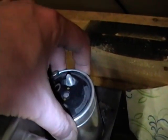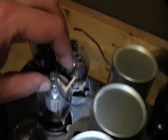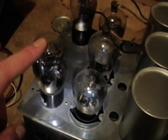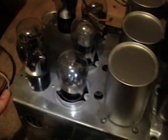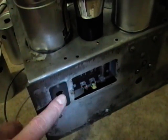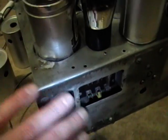So what else is left? I need to firmly seat this filter capacitor and hook the leads up. I need to repair these plate cap leads, and down below that bias resistor that I've modified for these — I don't know if that's firmly secured, and I want to check off the rest of the wiring and make sure everything's sound. And on the back side, I want to replace the power cord and replace a few other things. Like I had removed this plate here that covers the fuses — I'll put that back on. Here's where the power cord goes in. I've picked up some cool reproduction cloth-covered AC line cord, and a reproduction vintage AC plug, so I want to wire all that in.